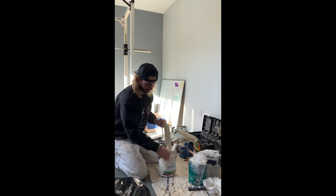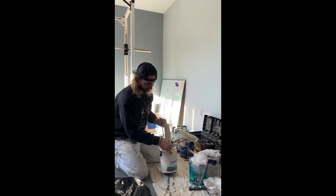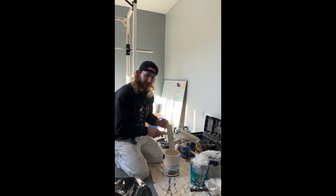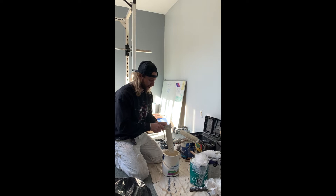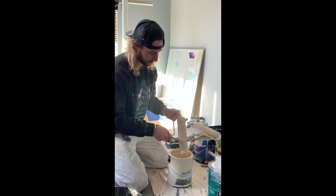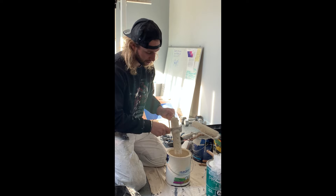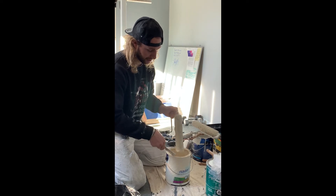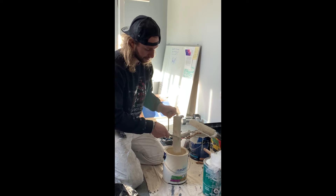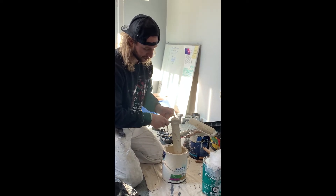This is the gallon for the color we were just using, so we've already poured out our cut cans. Your next step is to wring out the paint from the rollers, because you'd be amazed at how much paint comes out. You do this for a couple of reasons: one, you don't need to put perfectly good paint down the drain as you're washing. Two, it makes washing go by a lot faster.